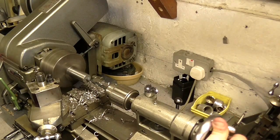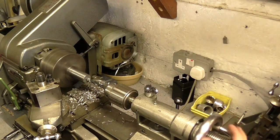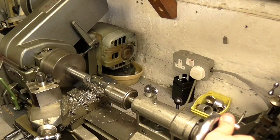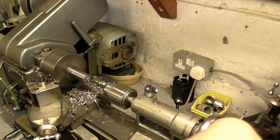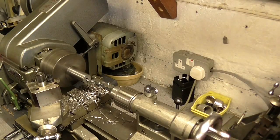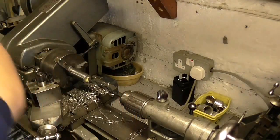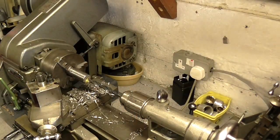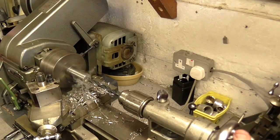First thing I had to do was turn up a mandrel, because the diameter of the nylon roller I was using wouldn't fit in the jaws of the chuck. So I'm just drilling there with a small diameter drill — 5mm or 6mm I think it was — just drilling the initial hole. We're giving it a bit of tapping and drilling fluid in there, which aids the drill bit and keeps things a bit cooler, and it generally makes for a nicer cut.